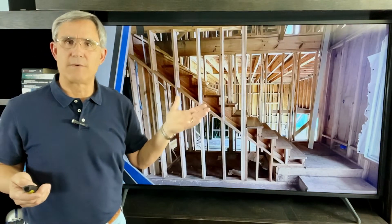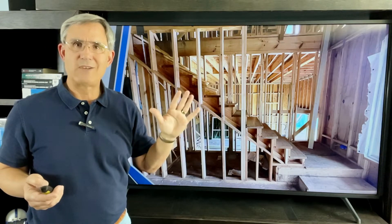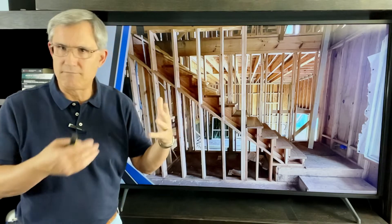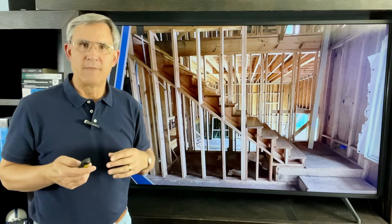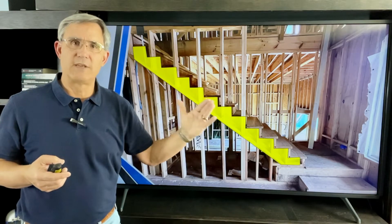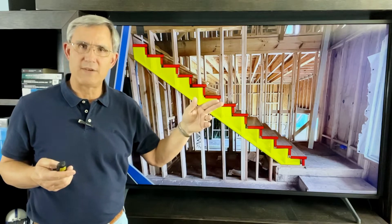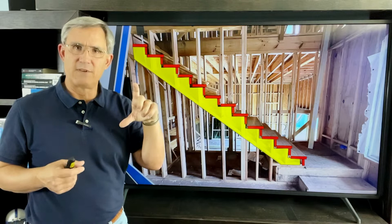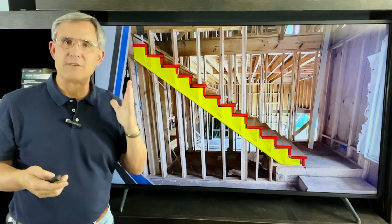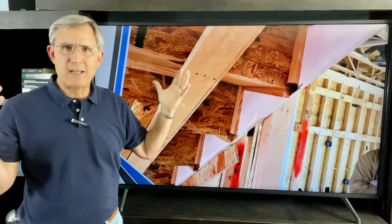Here's a real house with a real stairway. This one has walls on both sides — one stringer attached to each wall and a third stringer running down the middle. The wider the stairway, the more stringers you'll tend to have. This one is a little over three feet wide with three stringers. The framer did a great job, attaching the stringer at every stud with many nails. He used two-by-twelve treads and two-by-six risers. With the five-and-a-half inch of the two-by-six plus the one-and-a-half inch of the two-by-twelve, you're at seven inches — and we'll get into dimensions in the next video. It's almost foolproof when you use this type of lumber.